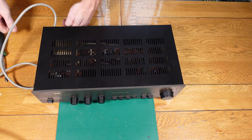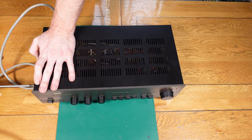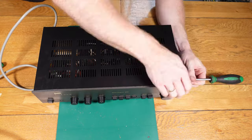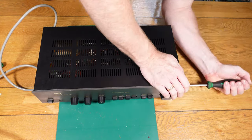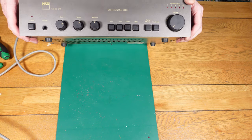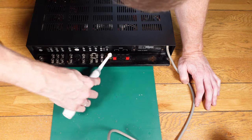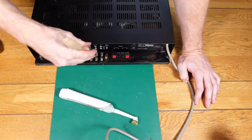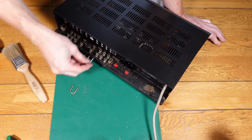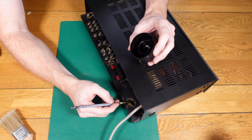The system now looks like a nice decent system from the outside. I also gave the interior a bit more of a clean after the capacitors were done — using a soft brush with some electrical cleaner sprayed in, trying to get off some of the harder deposits as much as I could. I didn't want to go too mad in case I damaged anything, but I got off the bulk of it. With the lid and front panel cleaned up the system would look great anywhere in the home. I'm also going to touch in the back area with black paint — I would have stripped it all down but parts have been riveted in, so brush painting it is less damaging. Providing it isn't used in a damp area, this should hold back the corrosion for a bit longer.